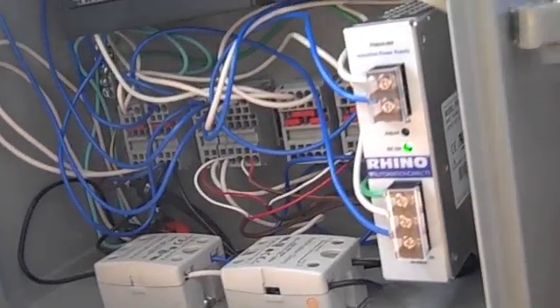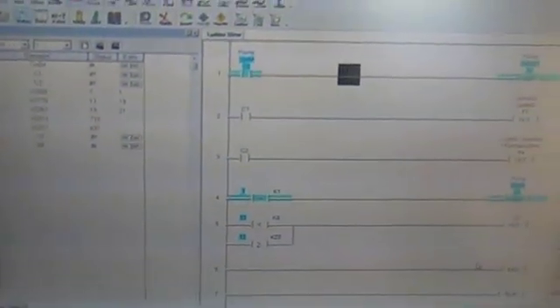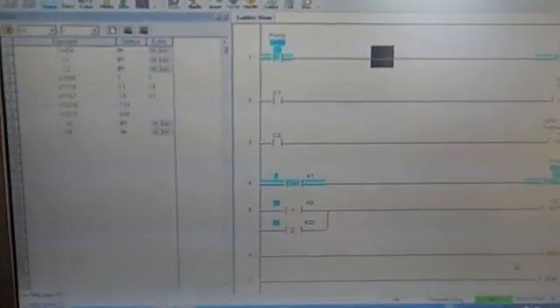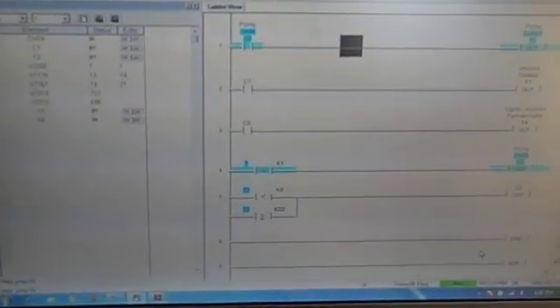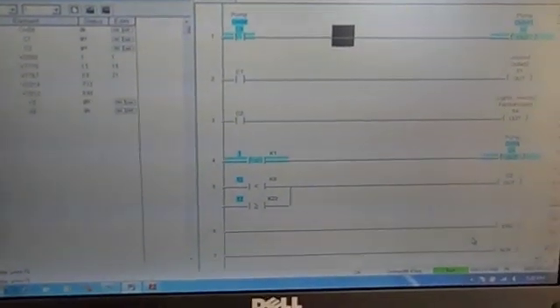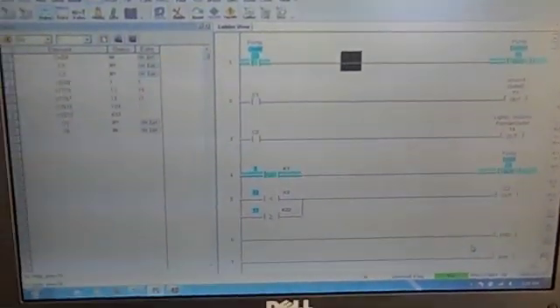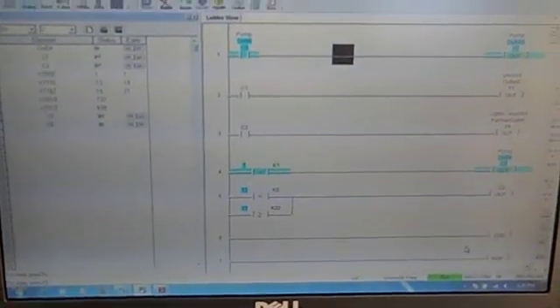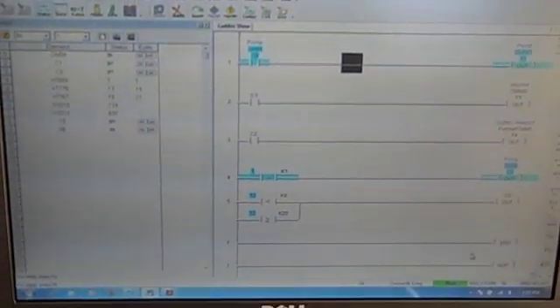What I still have to do is get a pH sensor hooked up in here — I've ordered it, but the parts are going to take a little while to get in. Over here on my laptop I'm running the PLC programming software, which gives me access to what's going on in the system: temperature readings, pump on and off, lights on and off. Ultimately I want to close out the PLC programming application once the PLC is set the way I want it, and then use a separate application that talks Modbus for data logging and plotting.